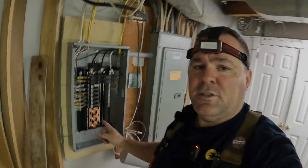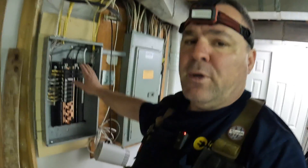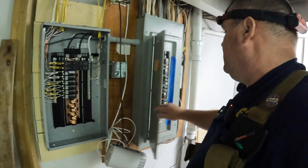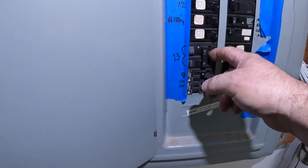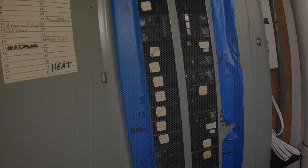You did miss a few things here — I did end up finishing up the subpanel but the battery went dead, sorry about that guys. Then I cleaned up, went out for lunch, picked up some materials and now I'm back. So the scope of work has actually changed. I was originally here to upgrade the subpanel so I'd have room inside my main breaker panel. I added a double-pole 30, but it turns out it's a double-pole 20 after I got information on the unit.